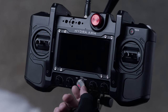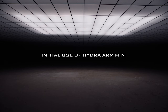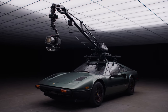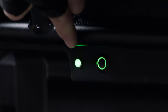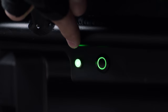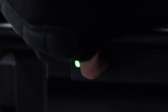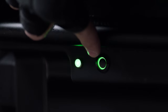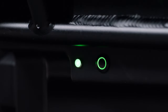Reconnect power to the arm by first connecting the controller communication cable to the base of the pan axis module and then reconnecting the controller. Reconnect the power cable to the base of the pan axis module, then reconnect the power cable to your converter before powering on the battery and then powering on the converter. Power on the controller by turning the center dial to the middle position. Once powered on, you'll notice a green LED indicator on the side of the pan axis module — a solid green LED indicates the arm is powered and control is active. If the light is flickering, that implies there is a communication issue. If you need to move the arm manually, press the button next to the green LED indicator to disable the controller — this button will start flashing, indicating you can now manually move the arm by hand.